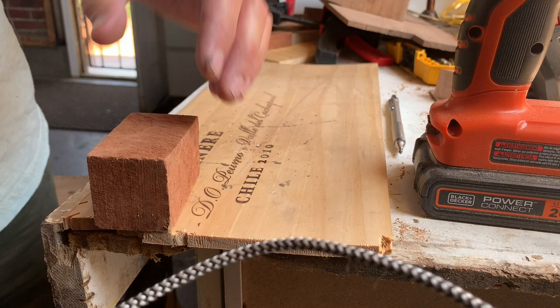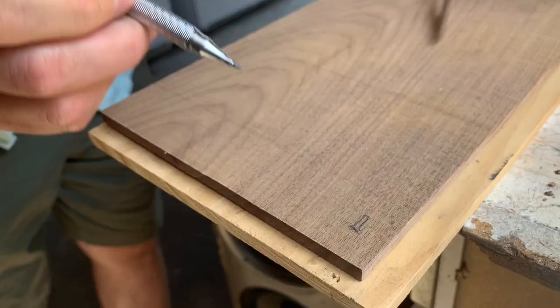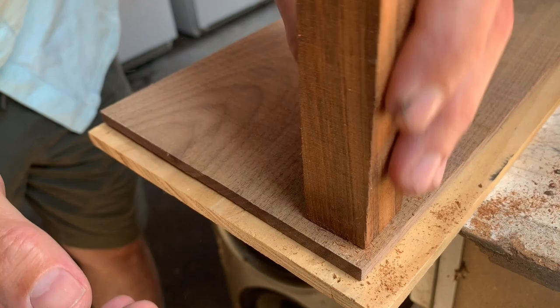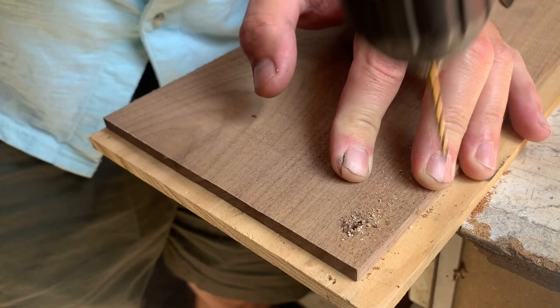I'm desperately trying to get through some hardwood with a jigsaw. The idea is you make a little shoulder, and it's much easier on a thin piece of wood to make a perfect shape that is exactly the shape of your tang. Drill your little holes, get your little jewelry files, and bada bing — you have a perfect fit. You'll use that thin piece for the shoulder and pop it on top of your ugly hole in the larger piece of wood, and it'll look beautiful.